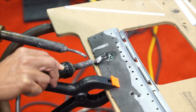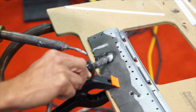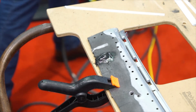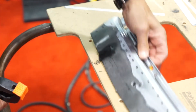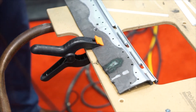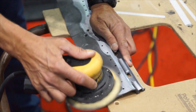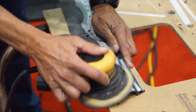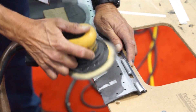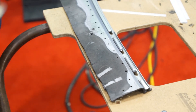Hopefully, when we get done with this repair, we won't have to use very much filler at all. That finishes it up, and then it's just a matter of cooling it off. Once it's cool, I'll go ahead and sand — I'll show sanding on a weld I did previously that's already cool. You take 80-grit and a DA sander, and quickly you can work that down. And a very nice finish on that weld — just a skim coat of filler, and it will be ready for primer.